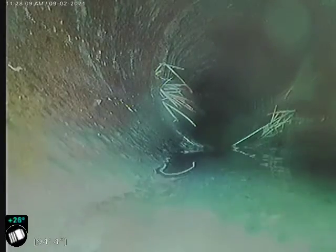More roots there, crawling down the edge of the pipe from that seam. A little bit of standing water there, about a half inch there. A few roots dangling. Back into a little more of a belly there again. Bellies are always a concern in a line. They tend to slow the flow down, which can possibly leave behind debris, causing more frequent maintenance and possible backups.